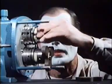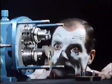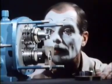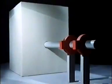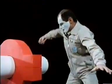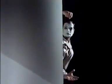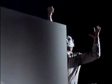This is what a mechanical seal looks like. But how does it work? A housing and a shaft. Fluid is stirred, pumped, centrifuged or treated in some other way within the housing. It's the shaft that initiates the rotary motion. The gap between the housing and the shaft has to be sealed. That's obvious.